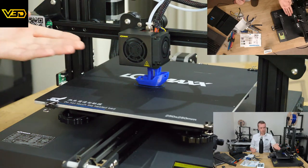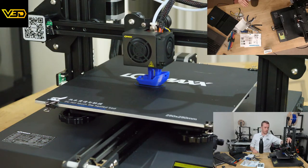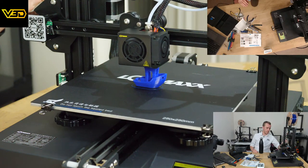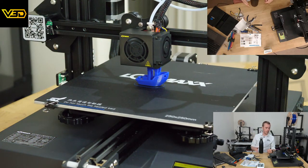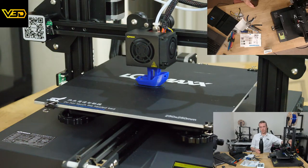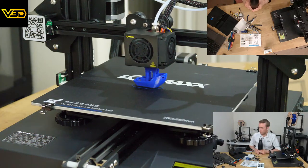Yeah, so here you go. Prime example. Printer looks identical, volumetric flow rate issue, there's a jam of some kind. Hit the peak of the volumetric flow rate, which means this, for some reason, doesn't seem to be able to print as fast as the Ender 3. It's skipping steps, which means either the torque on the motor is not high enough, and therefore it's skipping, or the hot end design is slightly different, and therefore can't push as much plastic past it.